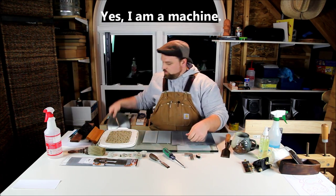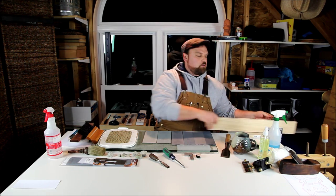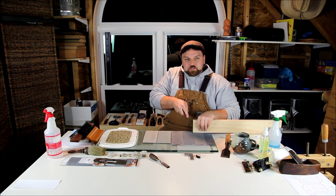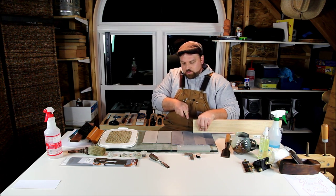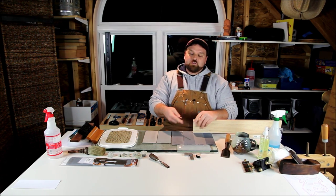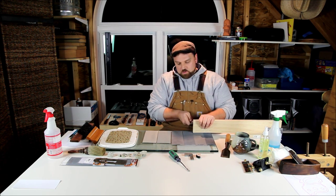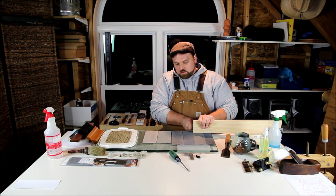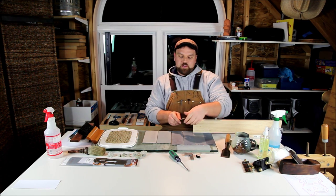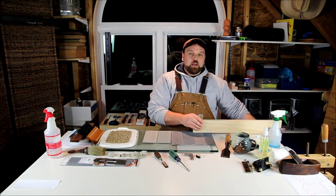You don't want to be trying to cram a screwdriver through end grain — you would never try to do this with a screwdriver. It leaves a nasty gnarled edge, you get grain blowout on the end, it just leaves a terrible product. But with a nice, honed, sharp chisel, I can pare this end grain all day long with no problem. It leaves almost a burnished edge, no blowout on the other side, it takes whisper-fine shavings and it was easy to control.